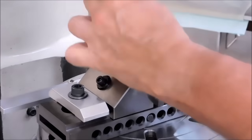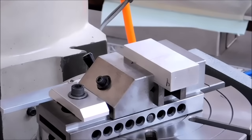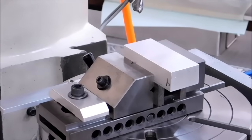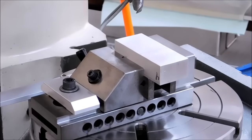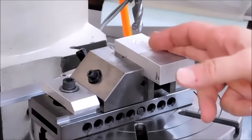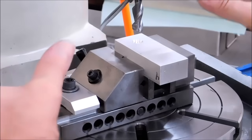Let's make a cut and see what we get. Just for yucks here guys, I'm going to make a part that looks exactly like a chain link and I'm going to use the full length of the block just for demonstration purposes. I'm going to return the X and Y axis to zero. Make sure the table is locked, everything X and Y is locked, part is locked. Now when I come down with this half-inch end mill, it's going to give me a half-inch spot face right there. Mission accomplished. I like the climb cut so I'm going to begin my cut on this side. I'm going to move 750 because of the radius and I'm going to take half the cutter which is 250, so effectively I'm moving my X-axis table one inch to the right.